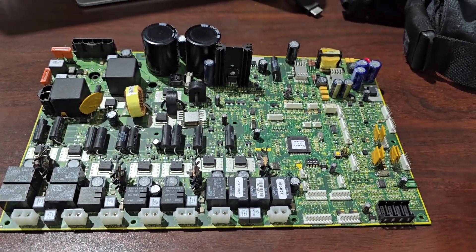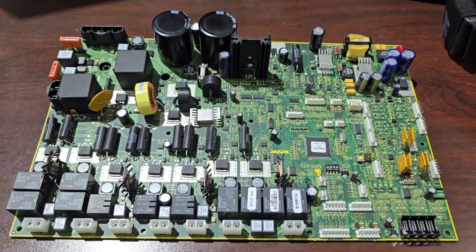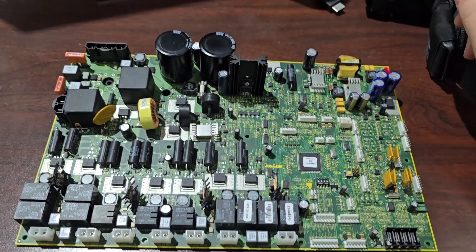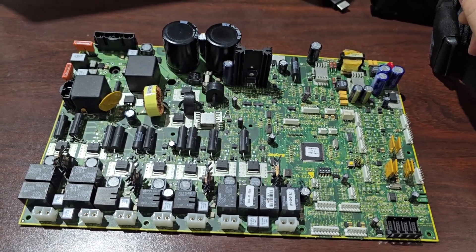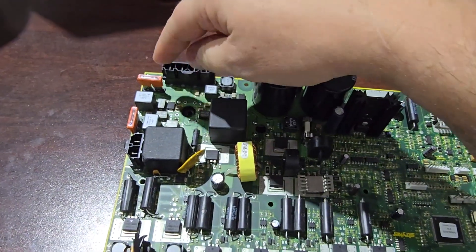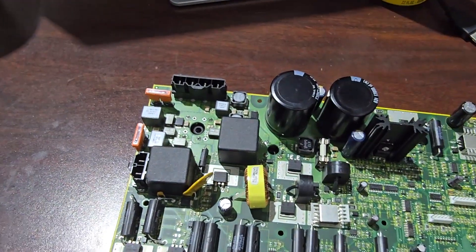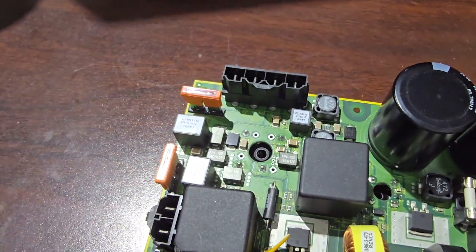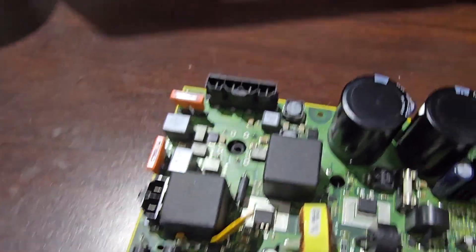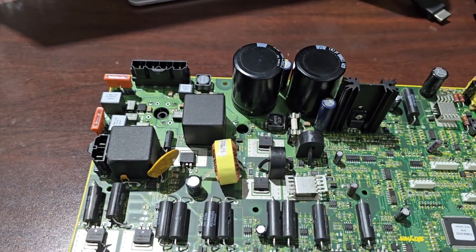Medical grade power supplies have some redundancy built in, but because this is a bed control board, slash power board, slash motor driver board, this board is not going to be powered on at all times. It's probably going to have something called standby power. I'm guessing — because I see two relays over here — that this is the power in and a battery port. Both power in and battery have fuses, right here and right here, because the batteries could short out and your incoming AC could short out. It's got two main relays, which is interesting.